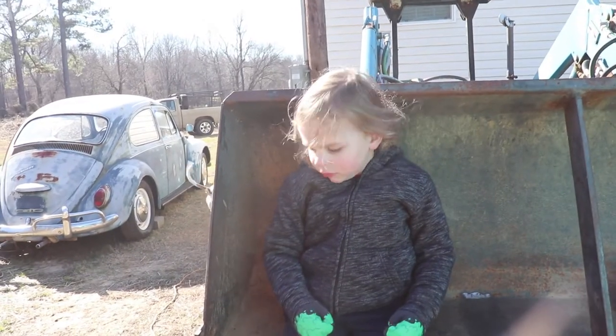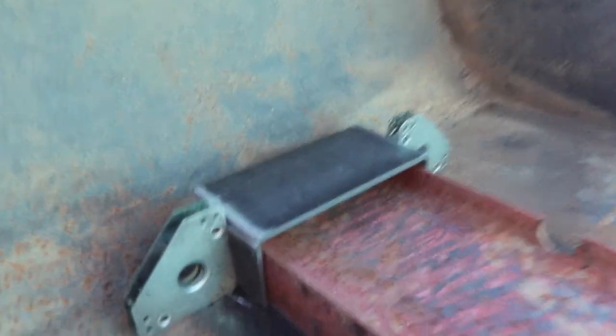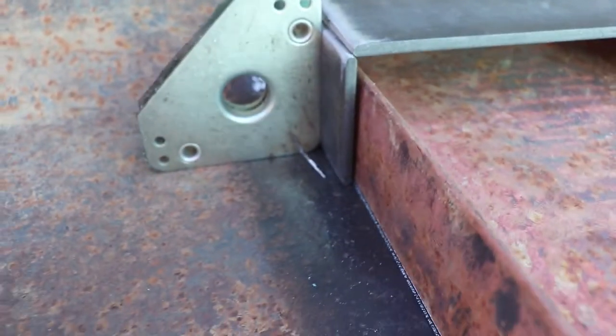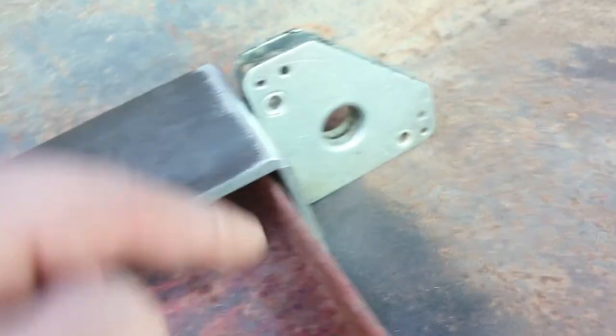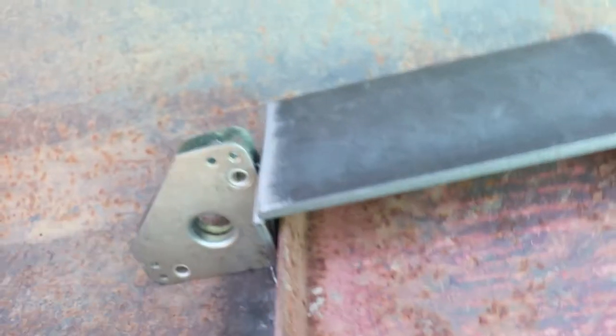All right. We got the supervisor out here with us. Let me show you where we're at. This is the scrap piece we used. I got my 4x1/4 inch plate. Give yourself extra room. We don't want this thing super tight, but we don't want it super sloppy. Got to have a little room on all sides. Got my metal cleaned up and beveled. I'm going to tack it on the outsides here. Tack it here and here. Gonna burn this in hot, cut these tacks, flip it over, burn the inside, and then we'll put that back on.